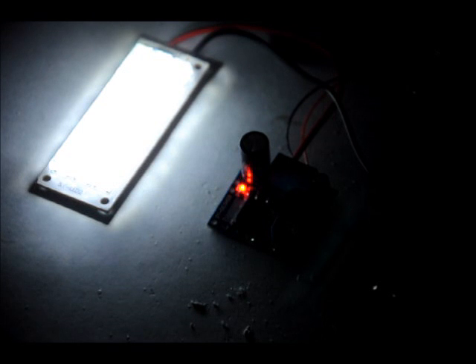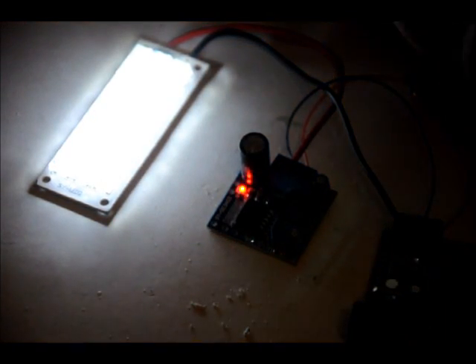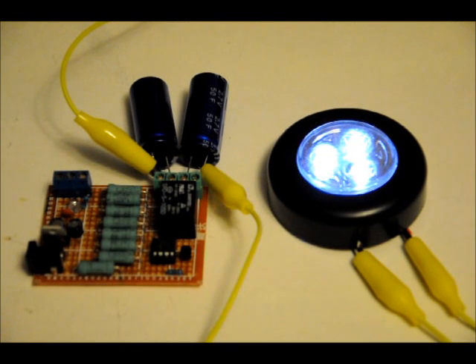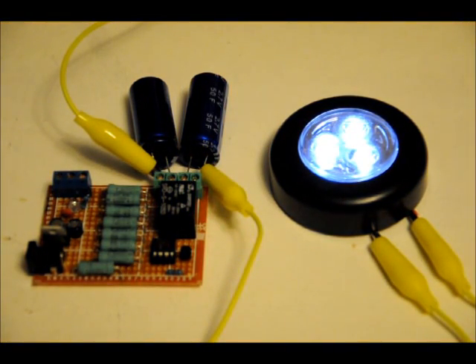You can leave it plugged in for as long as you want. Once it's charged, it's done — you'll know because there's a blinking indicator. Now I'll hook up this small dollar LED flashlight from the dollar store instead. This configuration isn't as bright, but it lasts significantly longer. That's coming directly off the capacitors at around 5.4 volts — pretty bright. And it works down to about 1.5 volts. This configuration lasts actually more than two hours, though after two hours the LEDs are barely emitting light. Keep in mind, that's using two 50-farad caps in series, which is 25 farads. If you put two 400-farad capacitors in series, you'd get 200 farads — eight times as much capacitance.